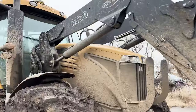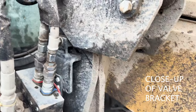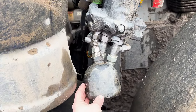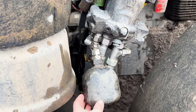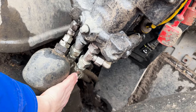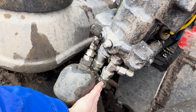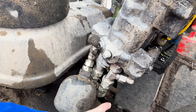This is the soft ride that takes some of the jarring out of the hydraulics while driving. These hoses going underneath are the pressure, return, and load sense hoses — they supply oil to the valve as well as taking oil back away from the valve to tank. Next we'll look at where those are connected to the tractor.